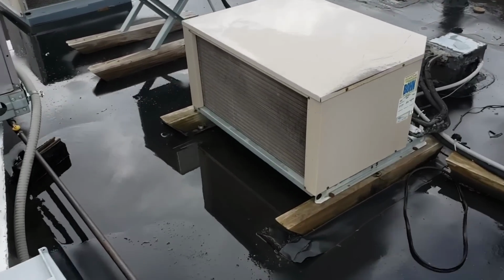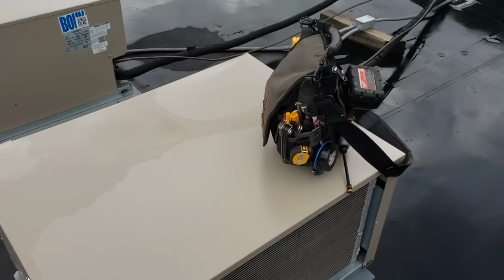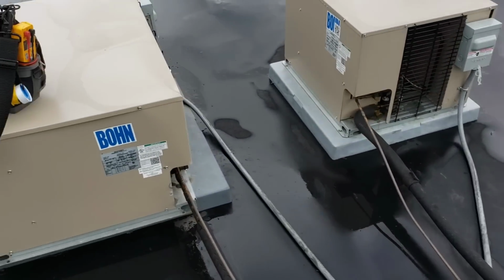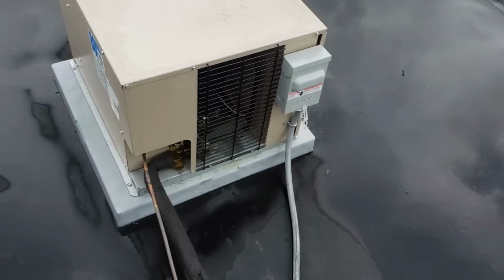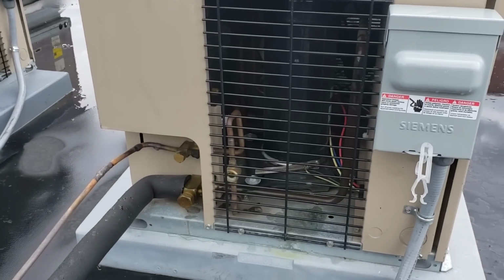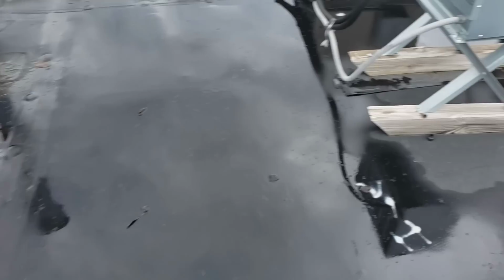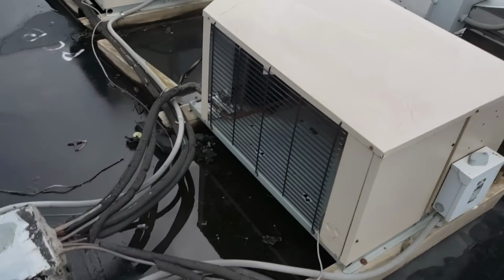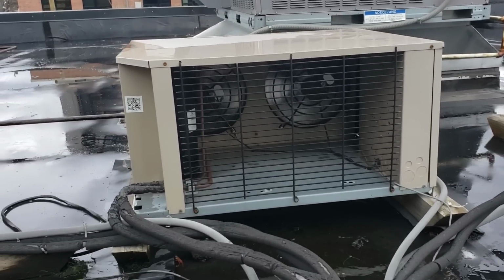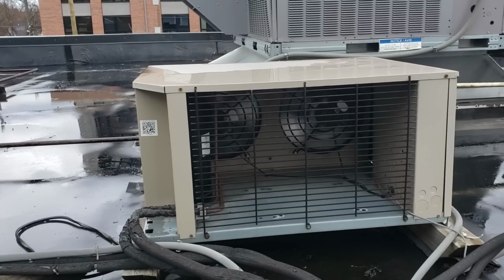You guys couldn't tell, we're up on the roof now. Just walking around, looking for the condensing units for these coolers. So just based off of the geographic location of the walk-in cooler, I don't believe either of these two belong to my walk-in cooler, my vault. That's a nice machine. It's kind of neat. I've never seen this model of condenser without a compressor. It's just a straight condenser. The compressor must be downstairs in whatever unit that it is in.